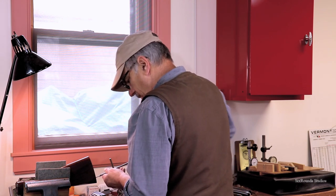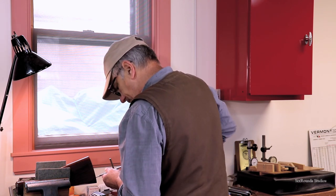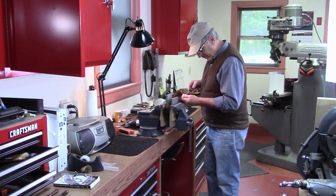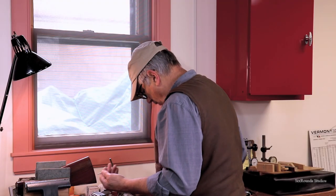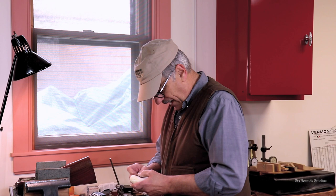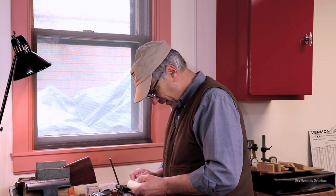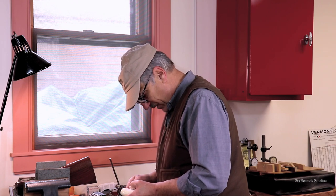And again, all I'm doing is pre-threading the hole. Because inevitably, every time you use a screw, especially Phillips heads, you're always dinging up or peening over the slots. I don't use the same screw to pre-thread. I use one screw each.